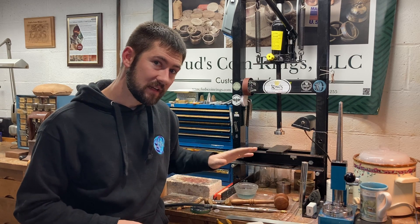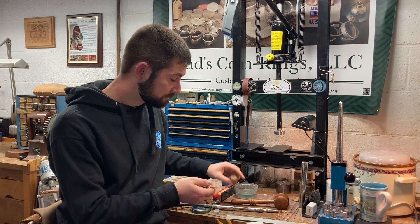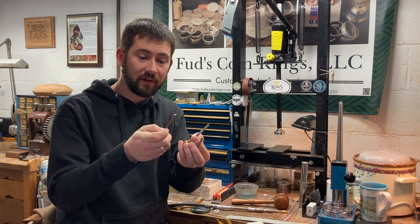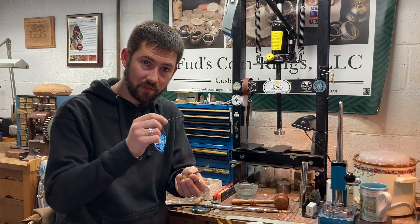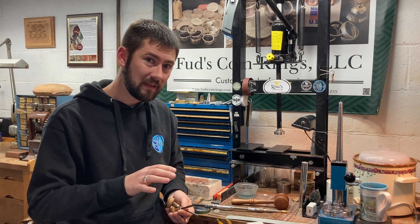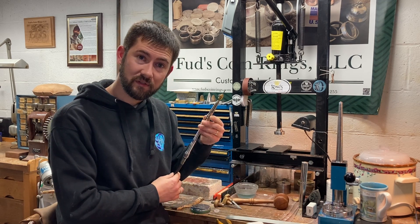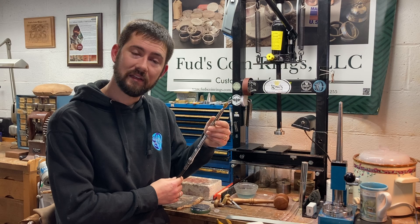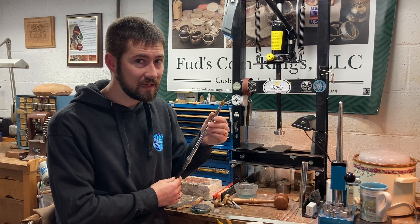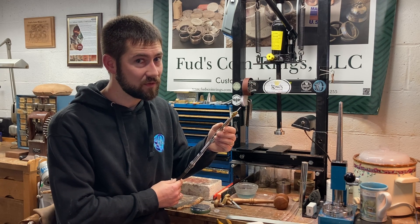Without acid etching, the traditional way to engrave into sterling silver was by using these gravers — very sharp pointed tools which are pushed through the metal. This takes years of apprenticeship and a lot of practice. Recently it's become a little easier using a fancy vibrating tool on my flex shaft, but it still requires a lot of practice and patience, which I don't have because her first meeting is January 2nd.